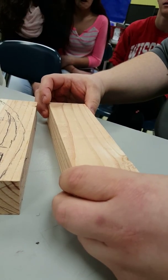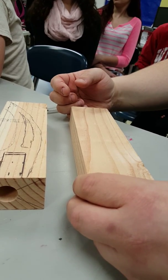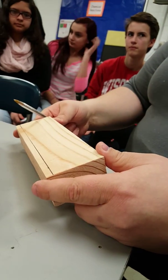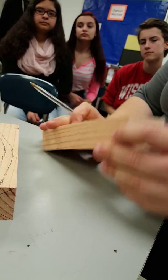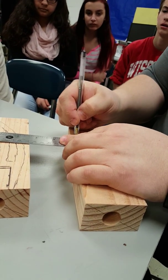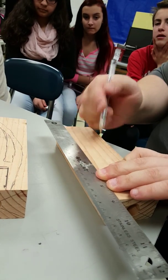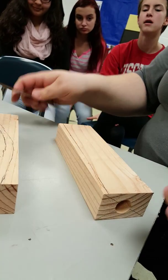What's the first thing we do when we're laying out our CO2 dragster? What are we going to cut first? The axles. So look at your block and figure out which way is going to be the best for your top, because your holes go in the back. We're going to make ourselves a quarter-inch up line — just like I did here — so that we can put our axles anywhere along that. I'm using the ruler. It doesn't really matter where I start, just make sure it's a quarter of an inch. Now I've got a quarter-inch line.